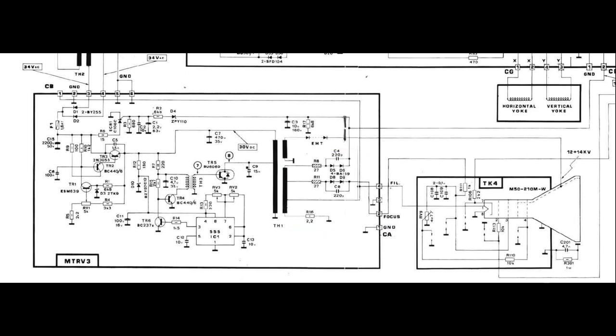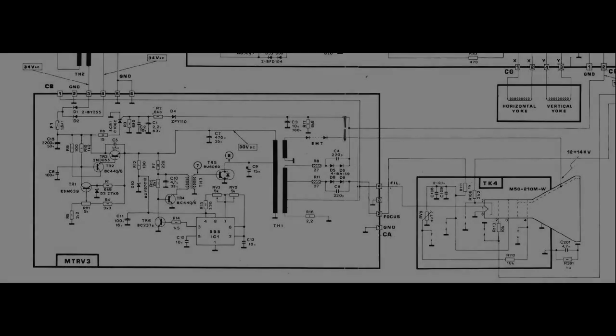Having successfully designed a complete CRT power supply for vector service, I can tell that this circuit is not a very good one, for several reasons. For example, there is no feedback from the secondary voltages back to the primary side, so they will vary depending on the actual quantity of vectors drawn on screen. However, it was used with good success on thousands of Italian-made arcade cabinets.